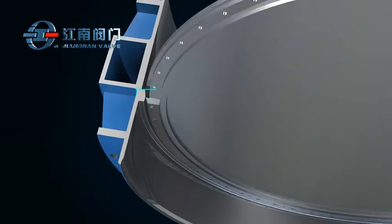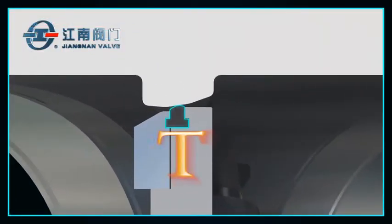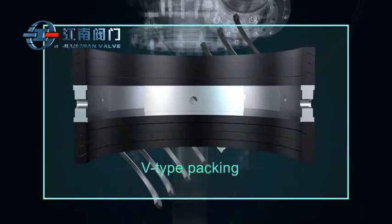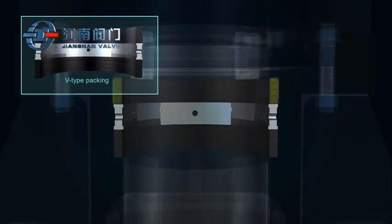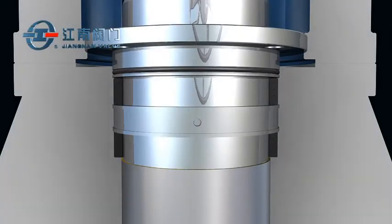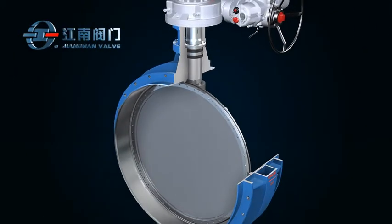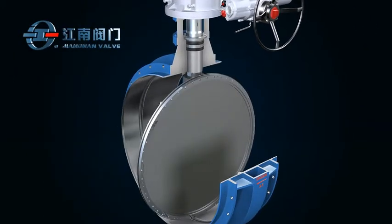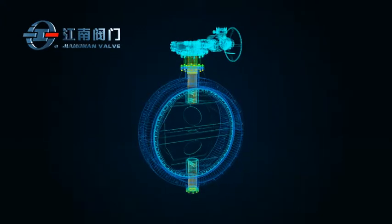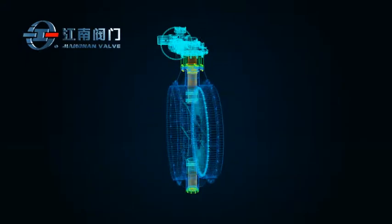The disc seal comes with a T-shaped cross section seal structure. This not only prevents blowouts under a vacuum environment, but also offers optimum seal with the adjustable compression level. The stem axial seal stuffing box has a double V packing structure. One set of packing is loaded and the other set of packing is backward loaded with a spacer ring placed in between. This structure can effectively shut off the contact between atmosphere and the medium within the pipe when pressure fluctuates, ensuring complete vacuum without having to use water or air as a secondary seal.